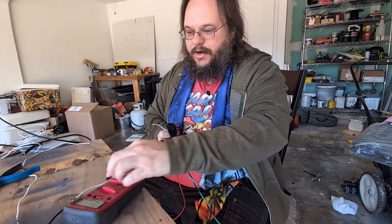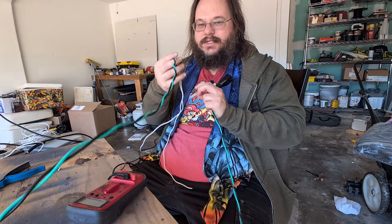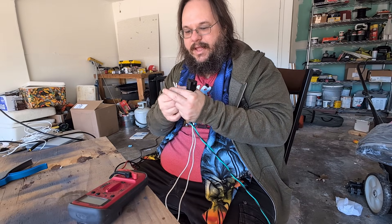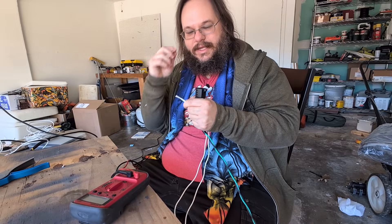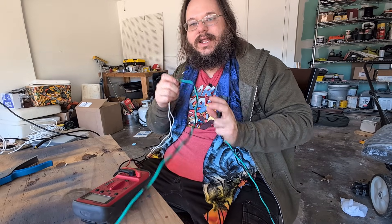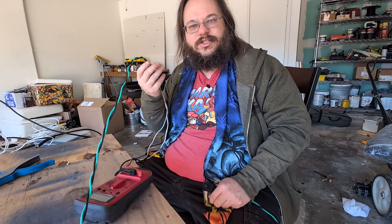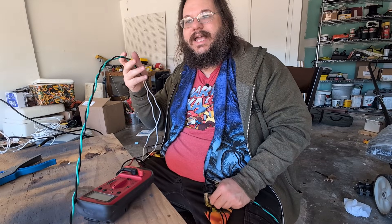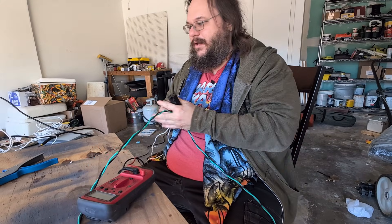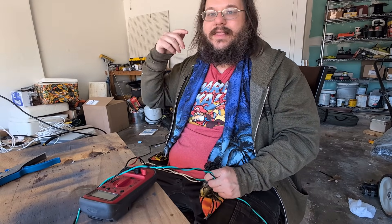Connectivity — perfect! Now I have two wires coming out of this end, which will be plugged into the connector running to the radio. I need them the same length, so I'll cut and solder these two ends together. This is going to be a fan dipole. The green line we're going to cut to about seven to ten feet for a 6-meter element, and the first section will be the 17-meter element. With the last extension cut, we'll have a 20-meter element, which also gives us 10 meters. So we'll have 10, 20, 17, and 6 — four bands on this fan dipole linked antenna.